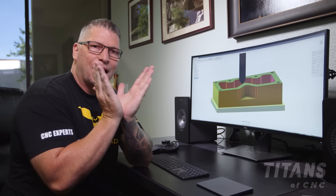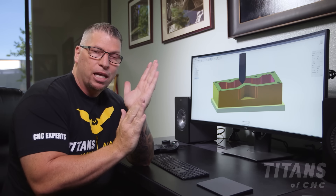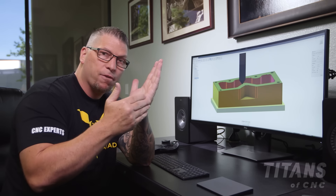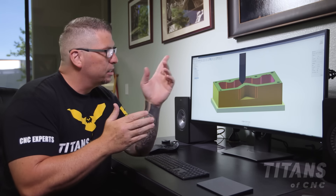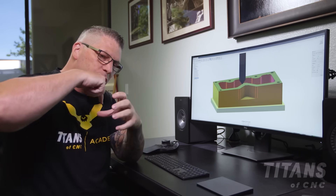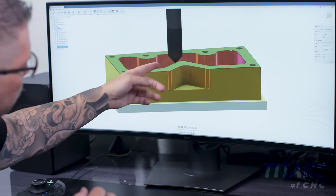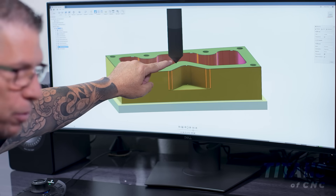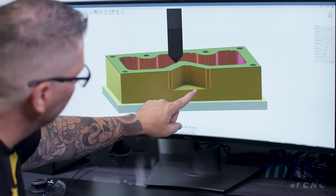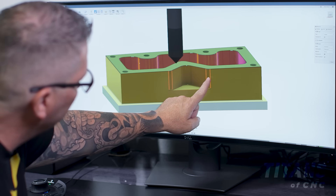In aluminum, I might say it's 100 thou and 50 off, 50 down. If I wanted a 10-thou chamfer, I'd go 60 down — so 50 off, 60 down. But because it's Inconel, I want to use the flute higher up and give it some room to actually cut since I have six flutes. On the top surface, I'm basically going to hit right in the center of the flute.